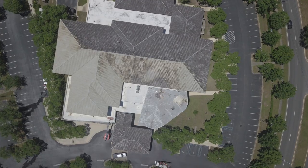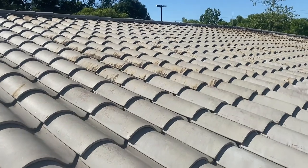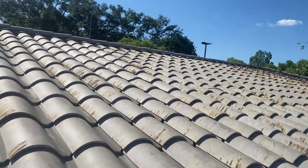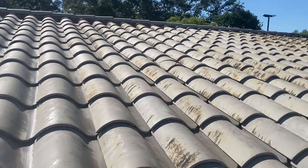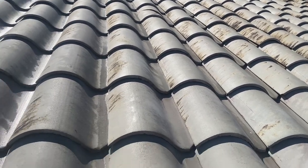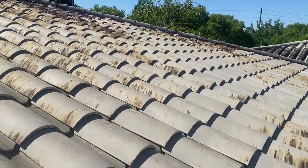Mix ratios: you need a hot mix on these roofs. I'm spraying this one at 50% of a 12.5 SH, going hot. Even on this 50%, I've still got some void areas and touch-ups that I'll have to come back and do. I'm putting down two coats of the 50% while I'm spraying — hitting it and then hitting the other side. So it's really getting two coats while we're spraying: two coats hitting left, top, right, front. Then I'll come back and do my touch-up spots. You can plan on three to four coats on a roof like this when it's that bad.